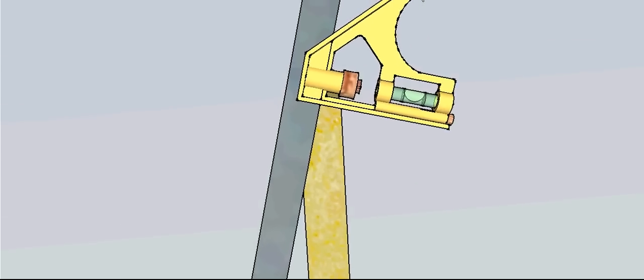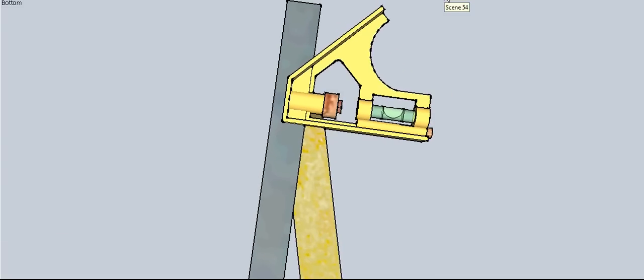the lower edge, this is our lowest corner, so from this edge, we need to mark 15 mil up the edge. What we're going to do is we're going to cut out a little bit of a checkout here, so that it actually sits around the top and provides some support underneath. So 15 mil in. Then you can grab your combo square and square down from that mark.